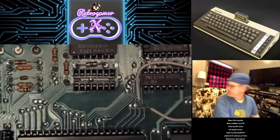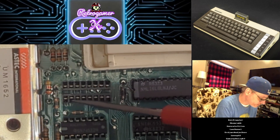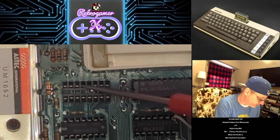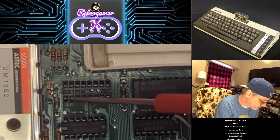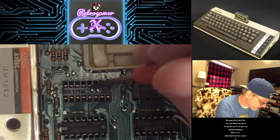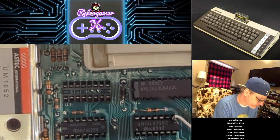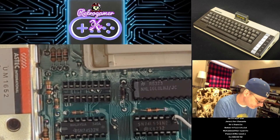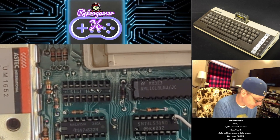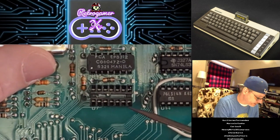On this second chip, I think it was pin 12 — let me count: one, two, three, four, five, six, seven, eight, nine, ten, eleven, twelve — yeah, pin 12 here just wasn't getting a good connection. I know it goes to the MMU but I forgot exactly which line — I think it was the input line from the MMU. That was also causing a black screen even when I had good continuity everywhere else. So yeah, it was just kind of a mess.